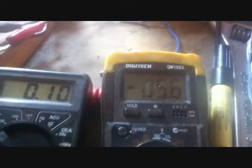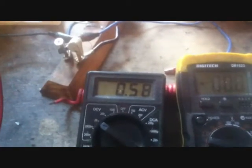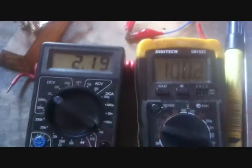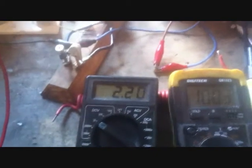Back. It's been 30 minutes and it's just run out. Still got 5.6. Voltage is bouncing back up — see if it needs a little rest period. Okay, let's hook it up. That drops straight away. Must have been residual charge left over, maybe. I'll put a charge on it — we'll do 2.18V. It's doing 100 milliamps on the 200 range. I'll leave that for a half hour.